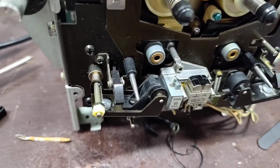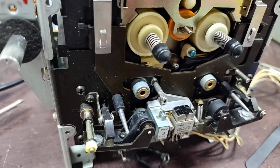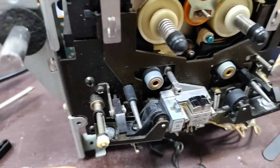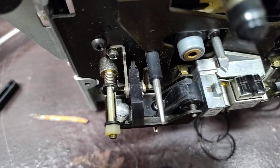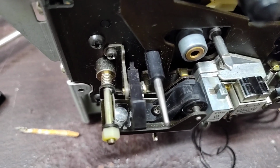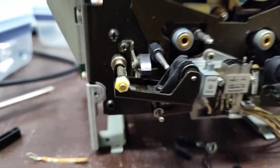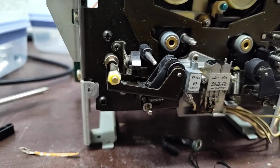Now, if you have a cassette jig that you can set all the heights and everything with, it's not a big deal. But if you're just winging it, then you definitely want to take that measurement. It's usually about 1.5 millimeters, maybe a hair shy of 2 millimeters, but yeah, 1.5 millimeters really. And that's under spring tension. So you also might want to make sure that there's no Loctite creeping around the head of that thing, because that will chew it up as you take it out.